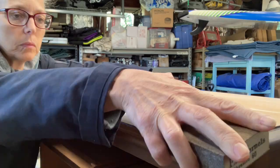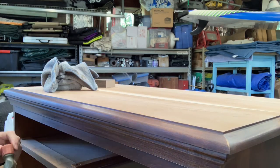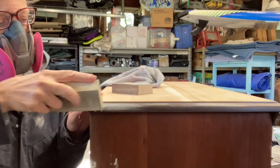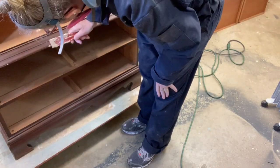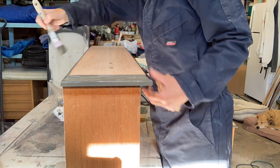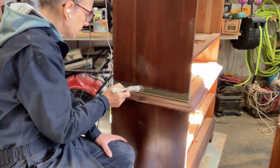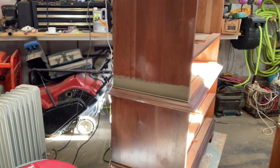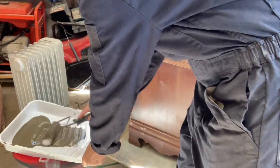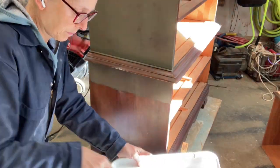Here is one of those spots that was so satisfying to sand — you can see how smooth it is after I sand it and wipe it off with my microfiber cloth. I love those microfiber cloths. I want to point out that I'm using my respirator when I am sanding the Plastic Wood X, because Plastic Wood X has silica sand in it, so you don't want to mess around with that — make sure you're wearing your respirator. I'm using my square brush by Zebra, and really I only use these two paint brushes and a roller. I really like these Purdy Ultra Finish Jumbo rollers — they're very soft and plush and they gave me a really nice finish. I really didn't even have to sand afterwards, which is unusual.